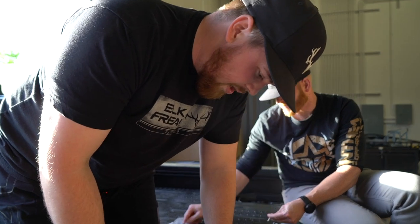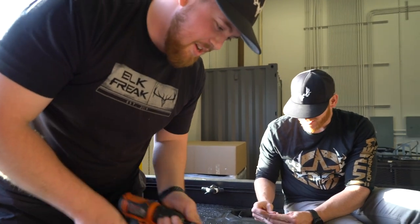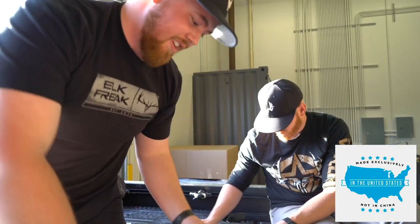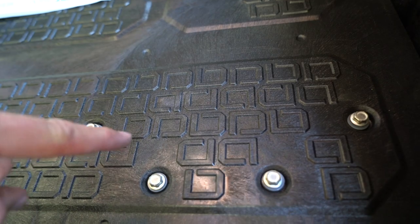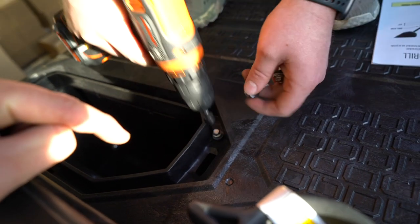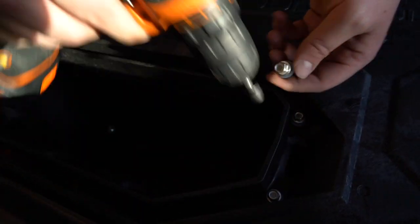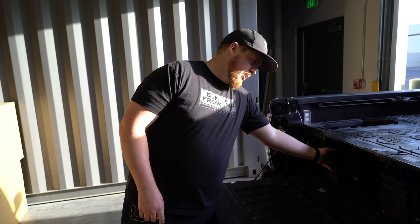This thing is brilliantly engineered — it's like they've thought through everything. The secret to putting the bolts in on the top is to do them all loosely first, because if you tighten one side down the others will be off. You kind of loosely do it until you get them all lined up, then we've anchored all the top to the bottom pieces.